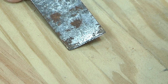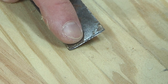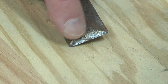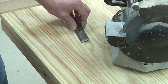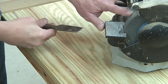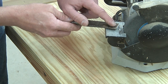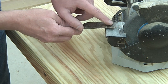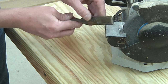The first thing to do is look at how bad your chisel is. This one has some rust, and I want to make sure the rust doesn't have pits that are too deep into the metal. Also, check for any nicks or gouges — you have to remove those first before you can get it sharp. The first thought everyone has is to use an electric grinding stone, but I don't like to do this because if you get the tip too hot, it will turn blue. The minute it turns blue, you lose the hardness. You'll still be able to get it sharp, but the minute you hit it against hardwood, you'll round that edge over immediately, making it utterly useless.